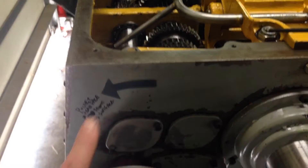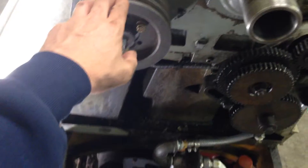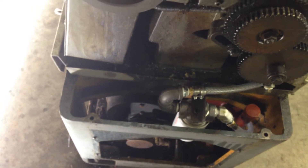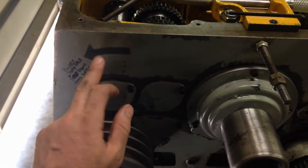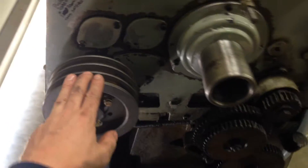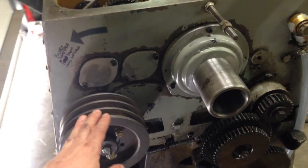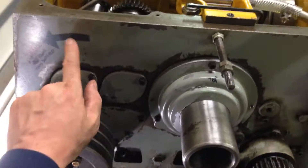Here's something interesting — I'm not entirely sure how this has happened, but some of the very early manuals show pulley rotation going clockwise, whereas this machine and the very latest manuals show it going counterclockwise. The pump will actually pump both ways, so it doesn't matter which direction the motor runs. Maybe they made a mistake in the early manuals, but you just set it right and it should be fine.